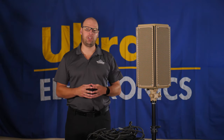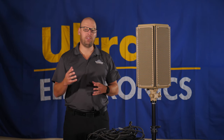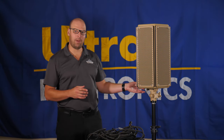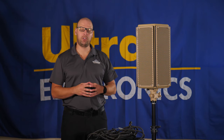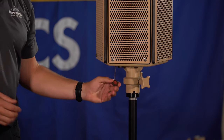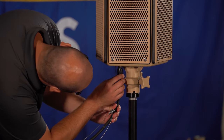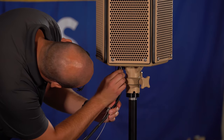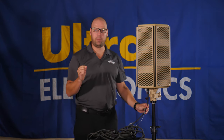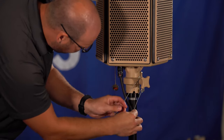When you're ready for the demonstration of the MA1 or MA2 speaker, ideal mounting height is anywhere from 30 feet to 75 feet. You can place the speaker on top of the tripod right here. If you need to put this on a lift, make sure you have some secondary fixation to ensure that the speaker will stay in place. On the bottom of this, you will see a cap that you'll have to remove. Take the speaker cable and make sure that you match it up accordingly, put it on, then screw it on and you should feel a little bit of a click. There's also some speaker strain relief — make sure that you place it on its side so that the cable does not pull out during the demonstration.